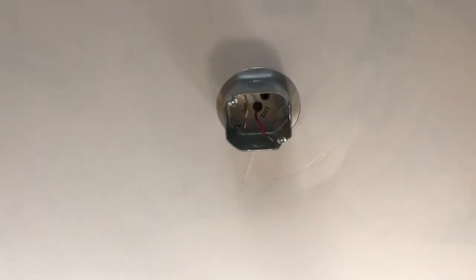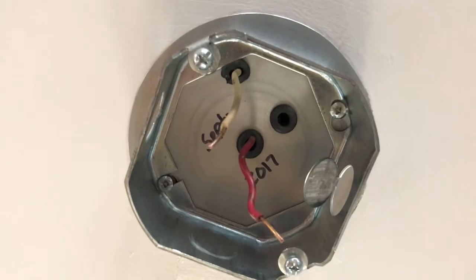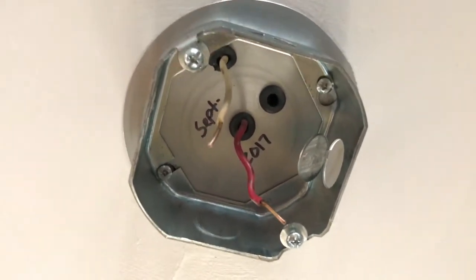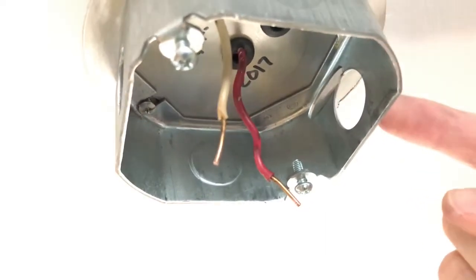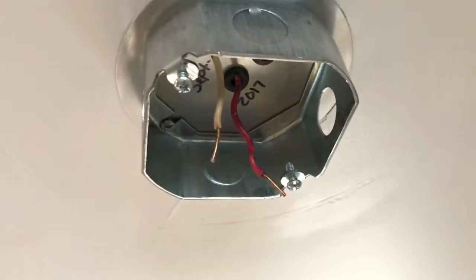I have the plate up there underneath the box with my wires poking down through. I ran them through a couple of grommets so the aluminum doesn't cut them — the aluminum is pretty sharp when it's been cut. I've got my neutral wire and my hot wire coming down. I'm starting to pop the knockout tabs out of my box to run my conduit in the direction I'm going. All you do is take a screwdriver and a hammer, knock it in, and then bend it back and forth until it breaks off. It's a little easier to do when you're on the ground, so keep that in mind.